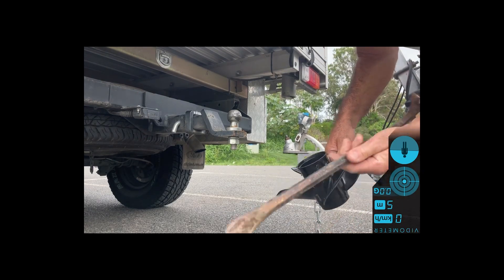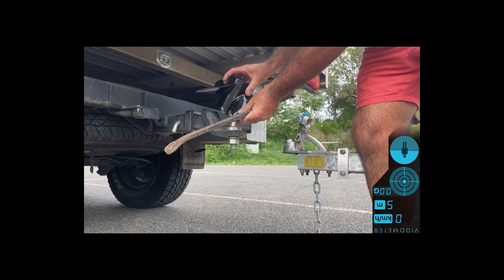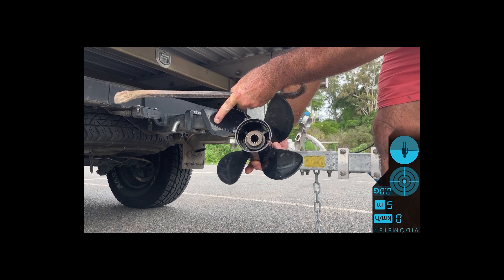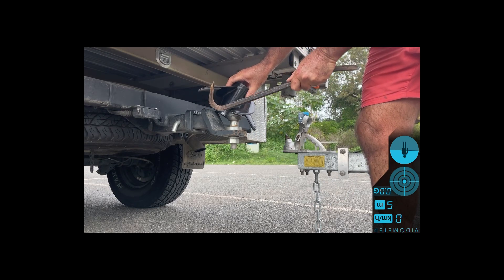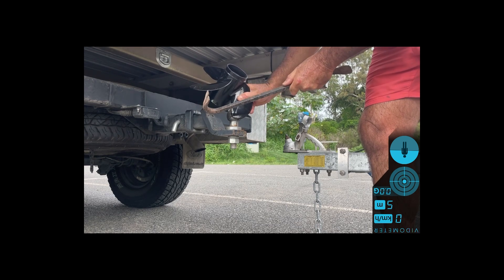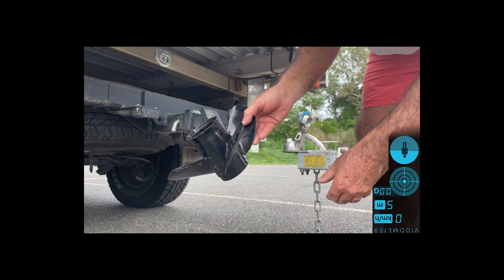I forgot my hammer so I'm going to have to use the crowbar. What you're looking for is just to get the edge of your prop — roughly towards the tip — just right on that little arc. Just aim for the curve of the toe ball, probably about five to ten mil in from the edge of the blade. Just give it a light tap. You can see roughly how it's starting to curve that blade up.